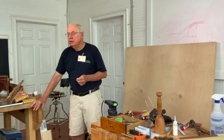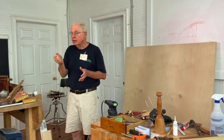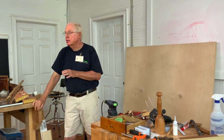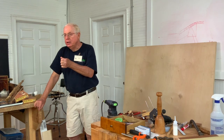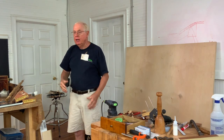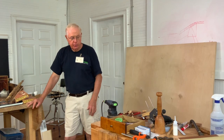The other good thing about it too is it's got all those little cutters. The chips that come off are about as big as your fingernail. Does not stop up your dust collection system. If you've got straight blade knives, you got those long curls that come off, they stop up your ventilation, your dust collection system in a minute. That one does not, because it makes little bitty chips. So your barrel, I've got one of those dust gorillas, Oneida systems, in a 55-gallon drum. I know I can get twice as many shavings in it now than I could when I had a straight blade knife. It just compacts so much better.